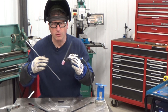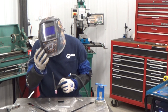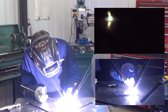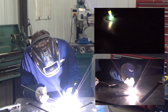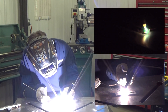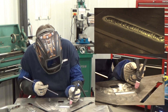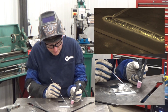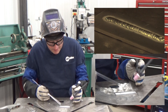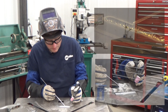You don't want the toes of the weld curving in to the center of your weld bead, because in a critical application that's potentially where a crack would start. I'm going to demonstrate a wide puddle profile first, then speed up the frequency for a tighter profile. Again, if this is a structural application, the tighter profile is going to be stronger — you don't want those weld toes curving too far in toward the center of the weld puddle.